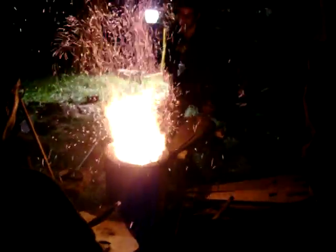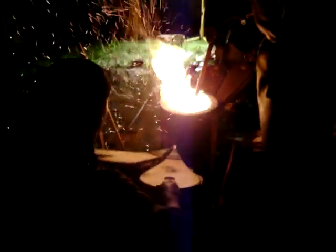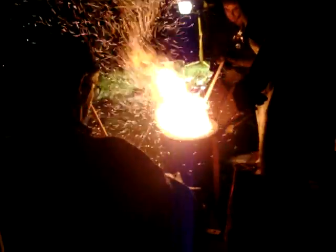You put quite a bit of that right on top of some charcoal — it'll melt and fall down. It's pretty cool. I hope they're gonna stick. I'll bring it melting again. It's important to keep the charcoal level full even when we're adding the tin, so we don't drop it. A taller crucible? A bigger crucible is the way to go — taller or wider, more volume either way. Got a taller one over there.